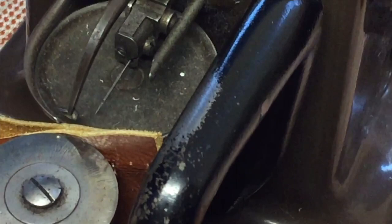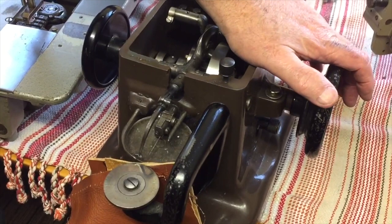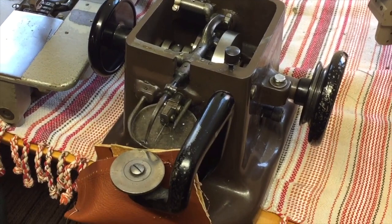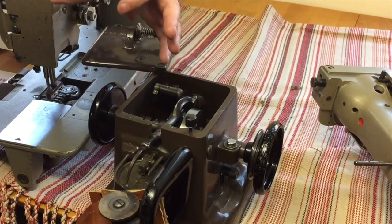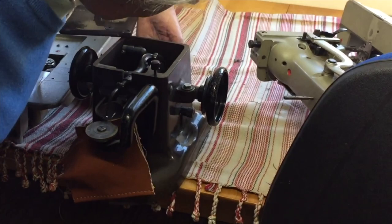It only slips back if those blocks feeding the movement get oil on them. It's almost a ratchet — little blocks with teeth on them, internal and external, concave and convex. If you get oil on them they slip; they need to be dry. If you splash oil down here it will get into them from the top — there's no protection. For stitch length there should be an adjustment — ah yes, that's the stitch length adjustment.